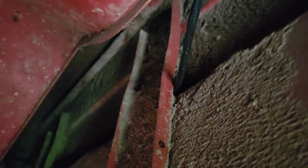And then I come over, sorry about all the motion, but basically on the back side of the right hand body, you got these support brackets, form a natural little hole in there behind the body panels. Follow those up and along, up into the corner. And once you're into the corner, I was able to secure it to the wiring that goes out there to your right hand turn signal, and the lights. And then follow that path into the cab. So that's where we're at.